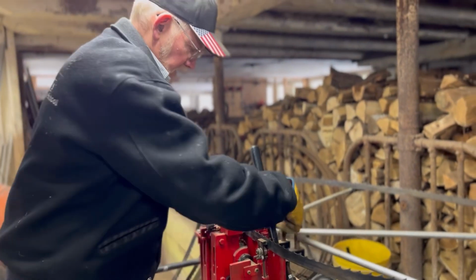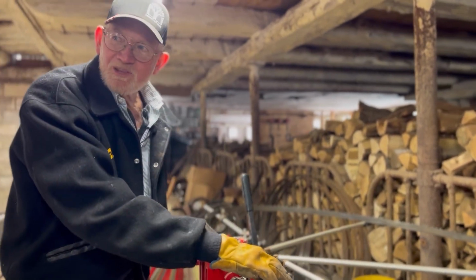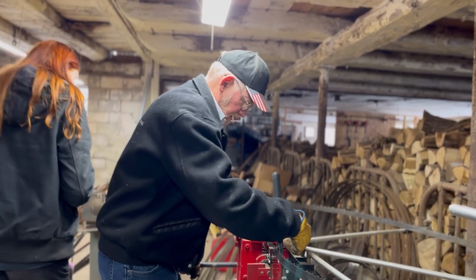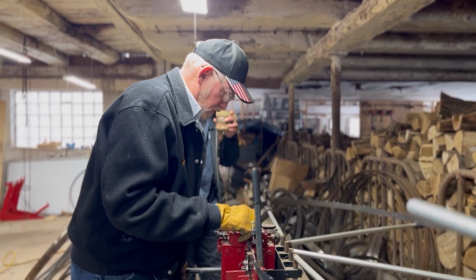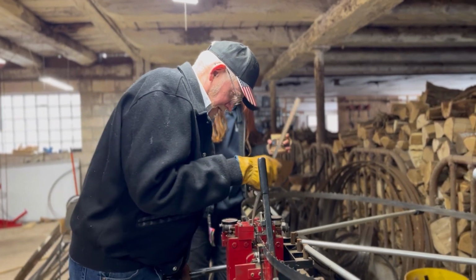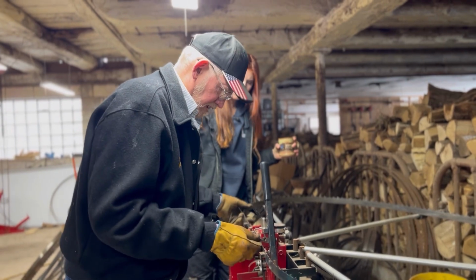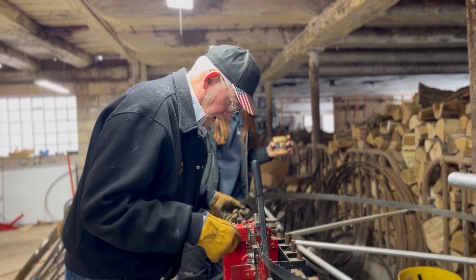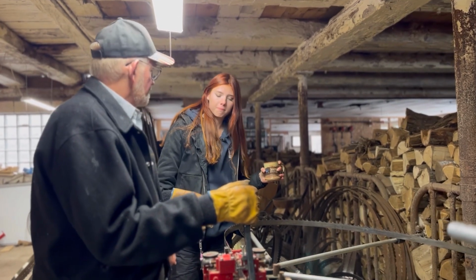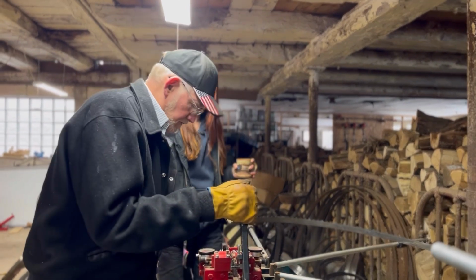What I have going on here, I have to say all these blades aren't the same thickness. So I have to set my, I try not to go over 25 thousandths. Why don't you think that they're the same thickness? You can tell when you pull on this thing. But they're supposed to be, right? Well, that's an inconsistency. They're close, but every batch of blades is another batch of blades, and it's kind of like dye lot colors on paint. Oh, okay, gotcha.